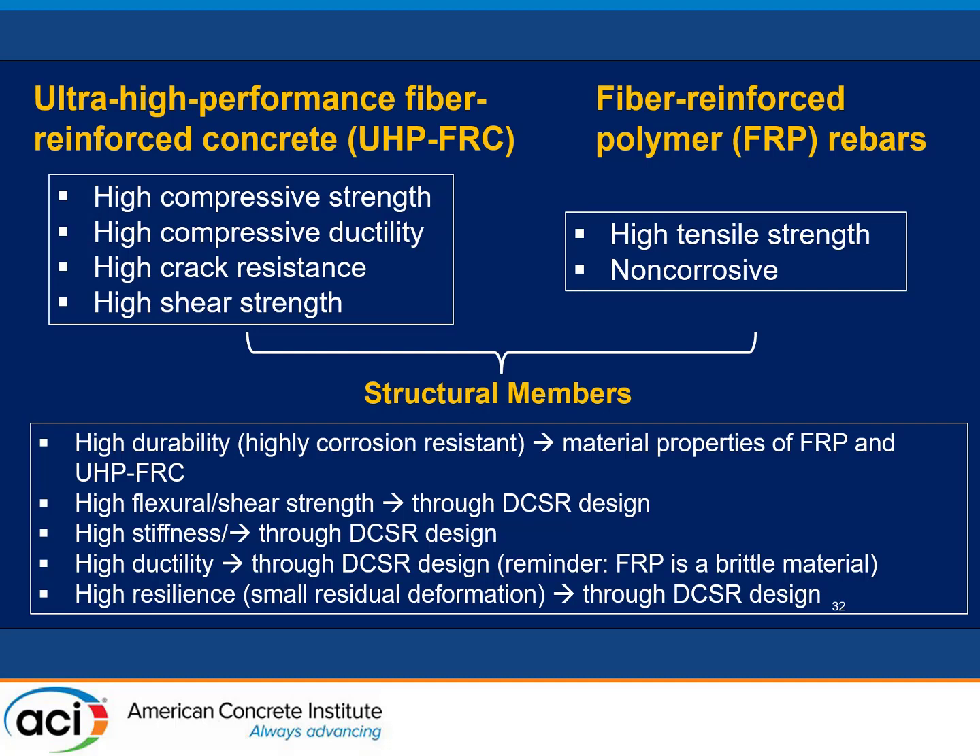Question: You rely on the ductility of UHPC in compression — does this mainly come from fiber reinforcement, and does fiber orientation play a role? Answer: Yes, the compressive ductility does come from the fibers. In our study we used up to 3% steel fiber and up to 0.75% PE fiber in full-scale column testing. Once we reach this fiber content, the ductility is achieved. Regarding orientation, it will of course be important. So far from our mixing, we have not seen much effect of different orientations, though I haven't looked into it in detail. Overall, we already got these results.